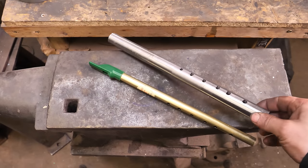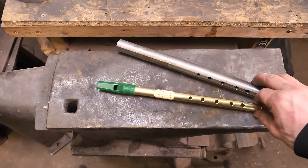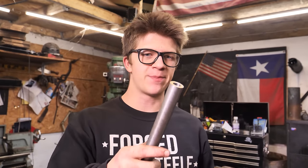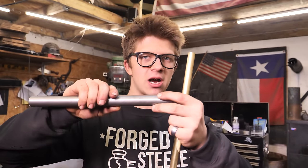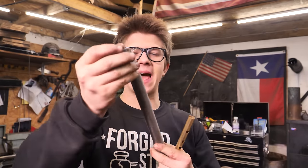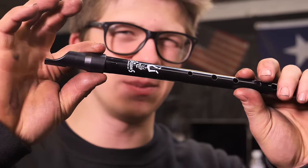So here's what I've got of the Damascus steel pipe whistle so far. I've got all the holes in. They're spaced the exact same as the original, and I have pretty much the same bore going down it. Now this is much longer. I'm going to be going back into the lathe right now. You guys left some incredible suggestions in the past video, and one of those suggestions was for me to be turning between centers — where you have a center in the chuck, a center in your tailstock, and then you have a lathe dog. I think I'm going to need to make a lathe dog because I don't have one. So the best I'm going to be able to do is chuck up just a little bit, maybe like an inch and a half, have the other end in a center, and now I'm going to be reducing this diameter, getting a nice finish on it, and then of course getting the diameter I need for the nozzle. The nozzle I'm going to use is going to be from this black pipe whistle here. It's tuned the same, so it should be able to then match the other one.